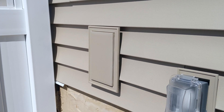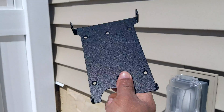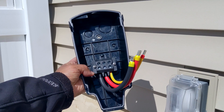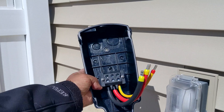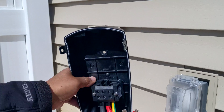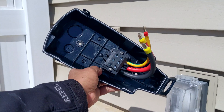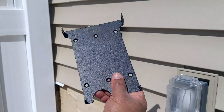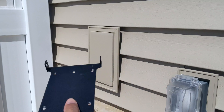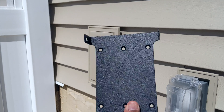When you get your Tesla charger, you're going to have two options: a bottom or rear entry plate, and a top mount plate. The top mount is designed if your power is coming from the top outside into the box — they suggest using that type. In my case, I'm coming through the rear, so I won't be using that. I'm going to be using the flush plate.